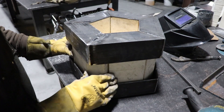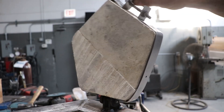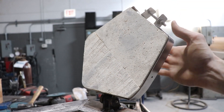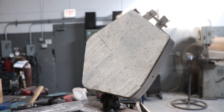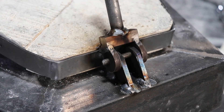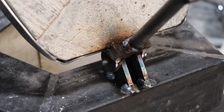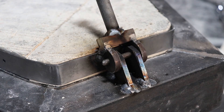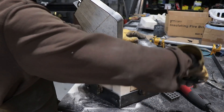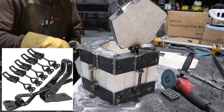Remember that the better your insulation of heat in a furnace, the easier it will be to maintain a high temperature. I used my cardboard template trick again to cut out two fire bricks in a pentagon shape for the top cap of the furnace. These two halves got squeezed together by some flexible metal banding, and I welded a hinge directly to the metal banding. This hinged door makes a world of difference when using the furnace — too many times I was ready to pour molten metal and spent too much time carefully setting the cover aside. The bolts could have been replaced by metal toggle latch clamps for easier and faster joining and separation.